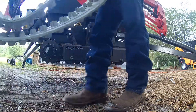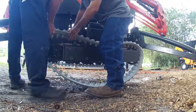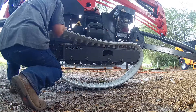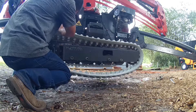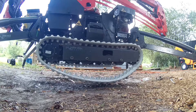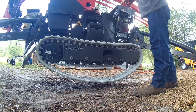Alright, at this point you start in reverse at the front. Get it lined up and start to get it half on, and then you just run the track in reverse and slowly walk it on. Be careful not to catch your fingers. Then run it a little bit just to make sure that it's on your cogwheel good and straight where it's supposed to ride.